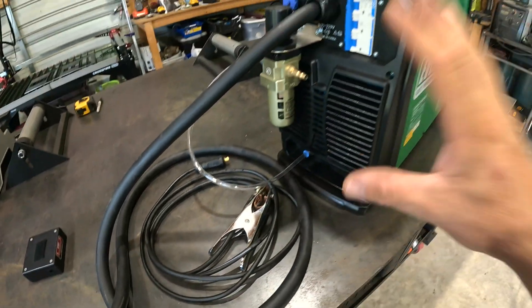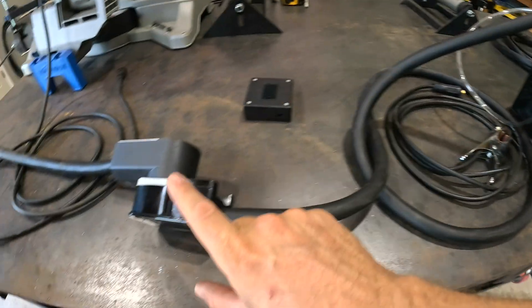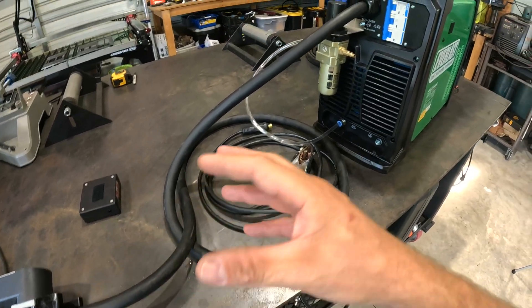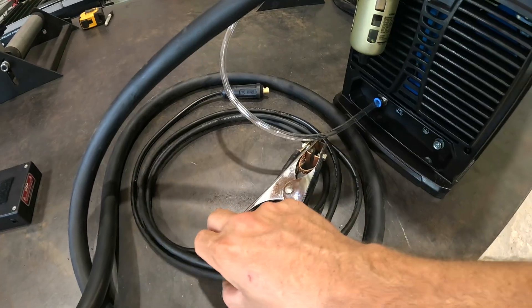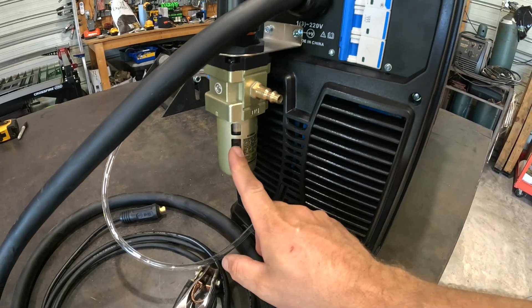What's included in the box? The 60 and 80 amp machines come with a NEMA 6-50 plug. The 100 amp machine does not come with a plug, so I purchased one — that's so you can hardwire it or wire for one phase or three phase depending on your setup. That's specific to the 102i. You've got a ground clamp, which is honestly kind of short so I ordered a longer one. Everything else is great — it comes with a regulator and water separator, although you'll want to put a water separation system in your shop. Clean air with no moisture is key with plasma cutting, especially to extend consumable life.